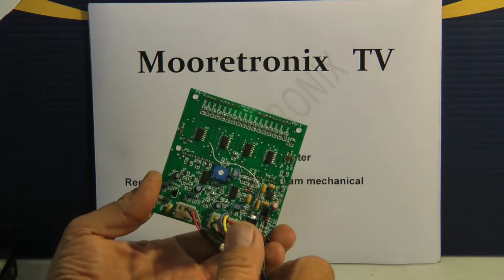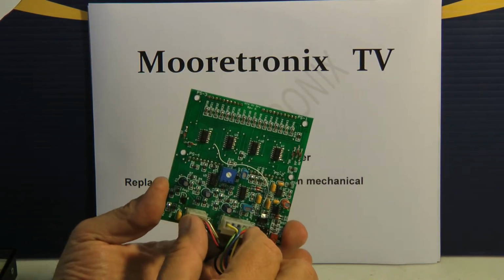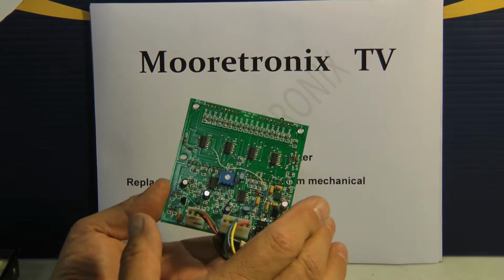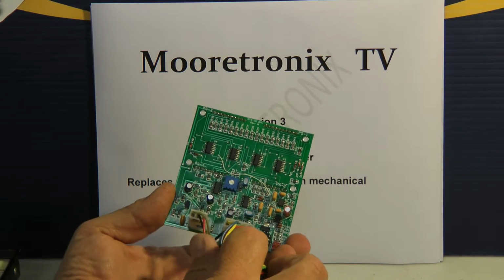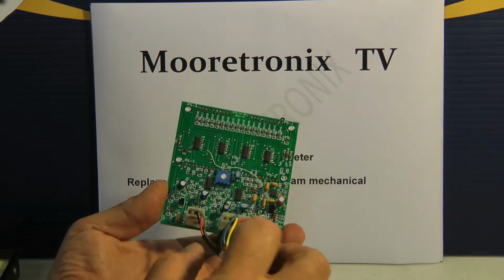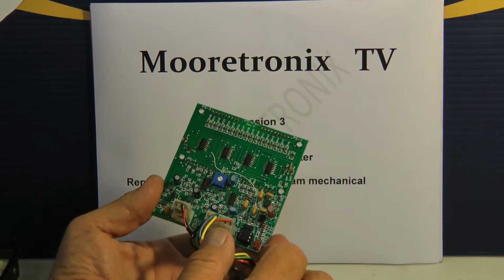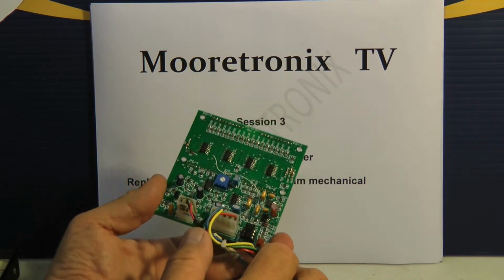If you're familiar with the PR&E meter drivers, they use a couple of connectors exactly like these. We stuck with this connector arrangement so that this meter assembly could directly retrofit to any PR&E console, whether it's a BMX-II, the later versions or the early versions, or BMX-III, AMX, ABX that have Sifam meters.